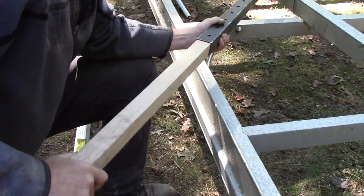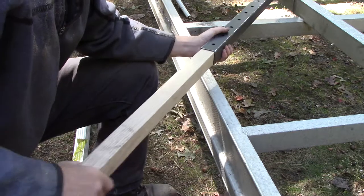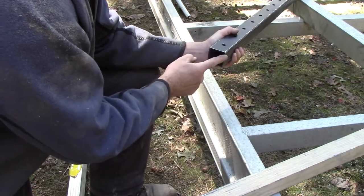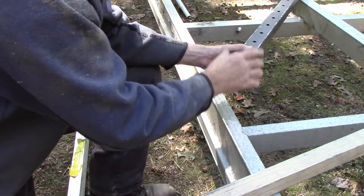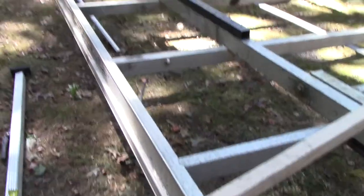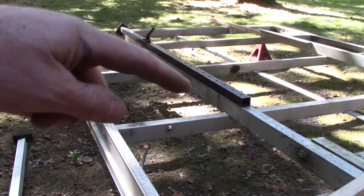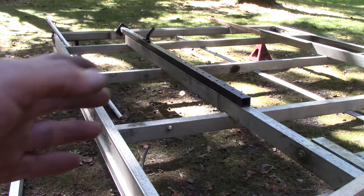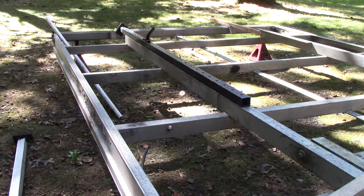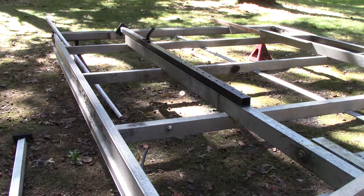This oak-in-aluminum piece is the exact fit. I'll set this up as my spacer with the oak inside, then the axle goes on top of that. It's galvanized but rusty galvanized - the axle is still steel - so I'm going to paint it with plastic coat or throw gorilla tape over it to stop the reaction. Then it'll be aluminum on aluminum with the oak inside, and there's no worry about the square tubing crushing when the axle is bolted down because it'll be solid oak inside.